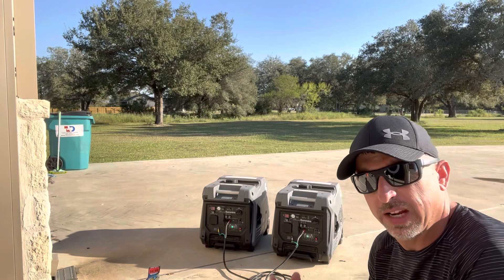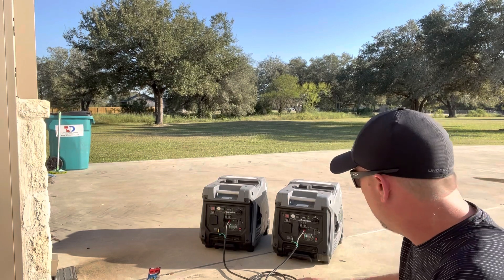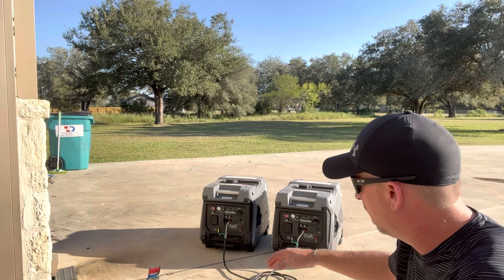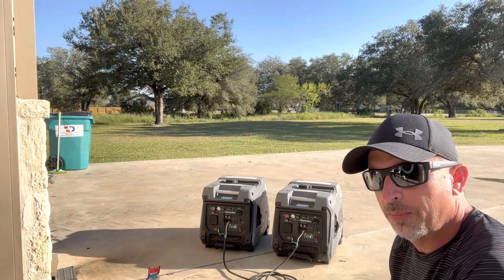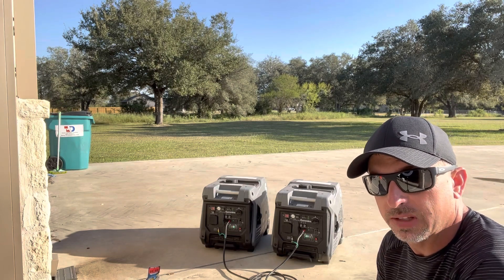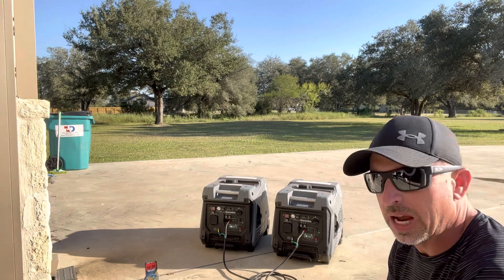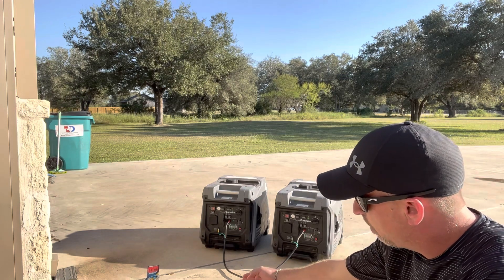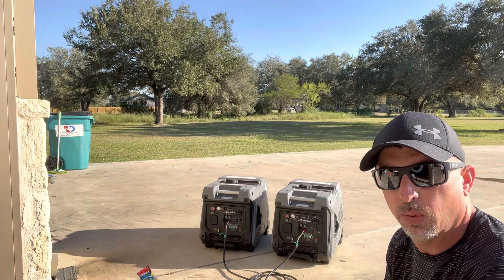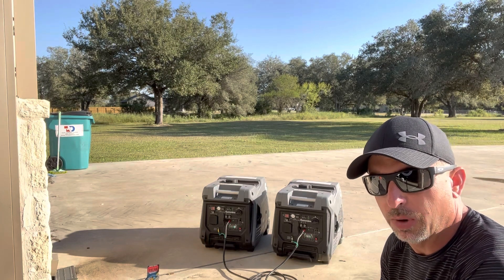Okay, we've got the first AC running. We're below 25% load on both generators and the timer has corrected to 9 hours and 10 minutes on half a tank — so paralleled with a full tank you'd probably get almost 18 hours on just over 6 gallons of gas. We're also on the full 50 amp because we're using a 50-amp adapter, so the wiring is adequate. Running on 30 amp would have really been pushing it with both ACs.